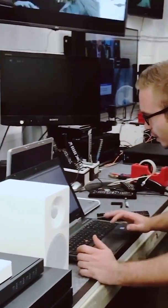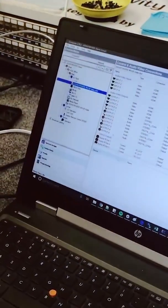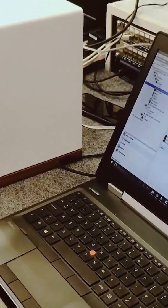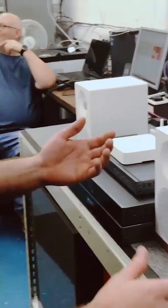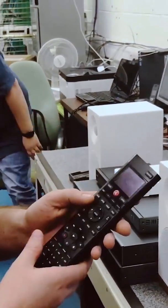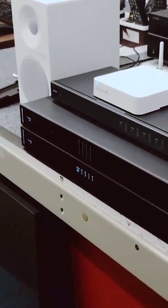So we've got it in Composer here — we've got the M-Hub Pro and the CA1 loaded in. By doing the connections to our devices and loading our drivers as standard, we're then able to send the IP-to-IR commands to all of the rooms, which works straight through the SR-260 remote. We have full control directly through the CA1 controller.